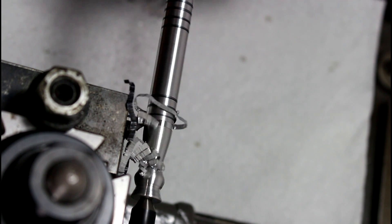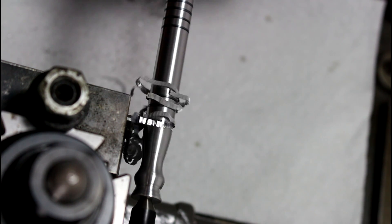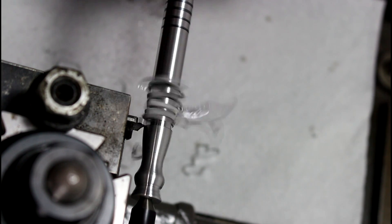Going in maybe 10 thousandths — see what it'll do. Here we go, 15 thousandths, here we go, 20. That'll work. Just let it cut there. In case I'm getting any residual, I'll pull it out before it chatters, then go in again — back to 20 thousandths. You can see my bit isn't quite cutting perfectly but hopefully I don't get too much chatter when I get out to the end here. There's 20 thousandths — pull out and do it again.